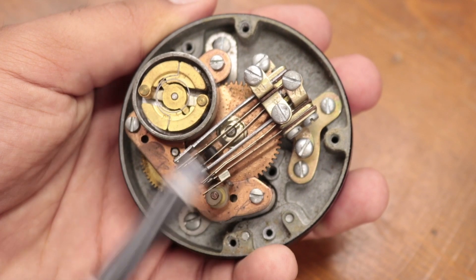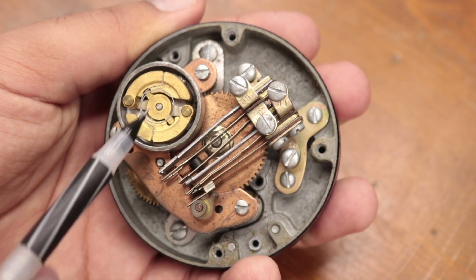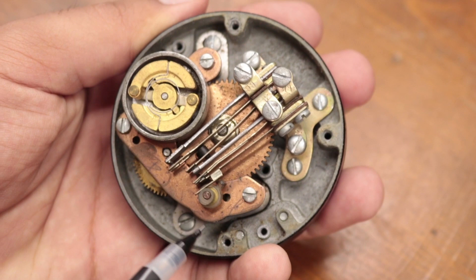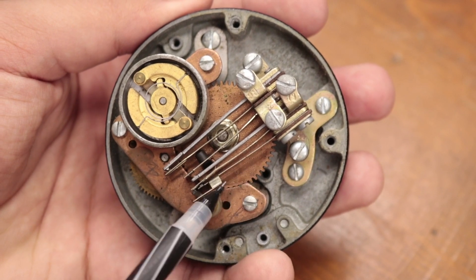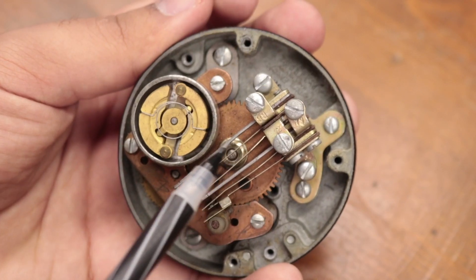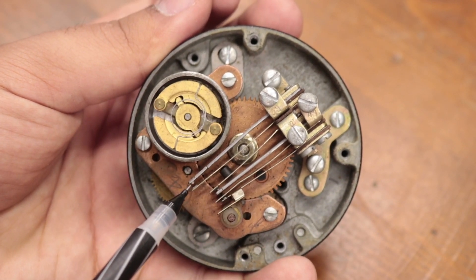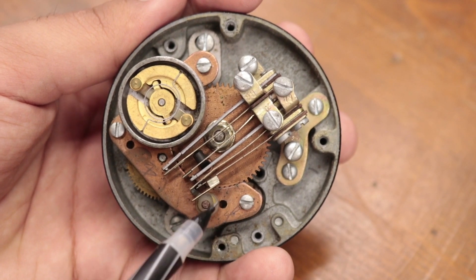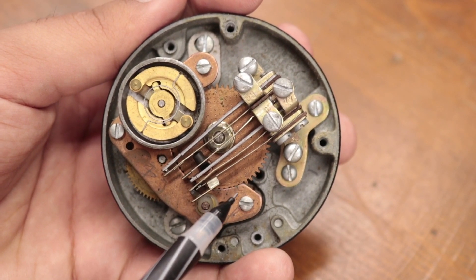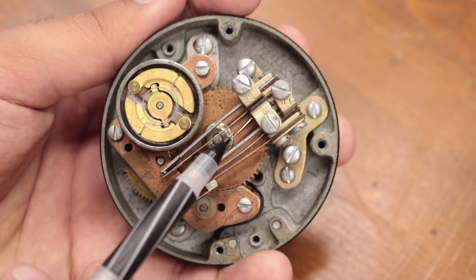Let's take a look at the back of the rotary mechanism. We've got some nice beefy tie points for the wires, and essentially all this is is three separate switches. So I'm going to release the dial and we'll see what happens. The switch on the right will rapidly open and close according to how far we turn the dial. The switch in the middle will latch shut while the dial is engaged, and the last switch on the left will open while the dial is engaged. Really, all we need is the switch on the right to count the number of pulses, which will turn into whatever number we want to dial. Although it might be nice to read the state of one of the latching switches so we know exactly when dialing starts and ends.